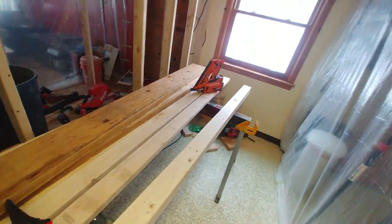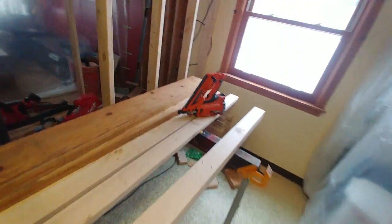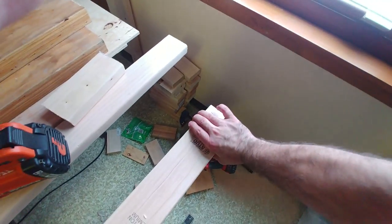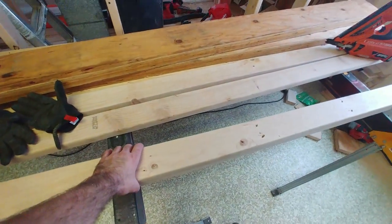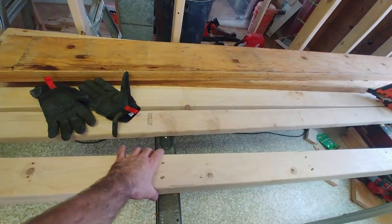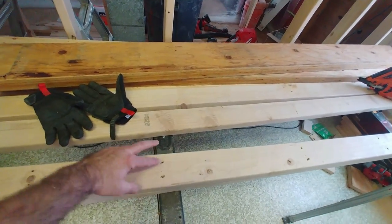Now what I've got is levers, two long levers, and I use them like scissors down at this end. I can roll back and forth, or I can use a big bar clamp on there to shove one way or another to drive how flush this is. I went along and it started to walk out. So I went down there and I used the clamp to drive those nice levers, made easy work of steering these side to side like scissor blades until it was flush. And I pin it here.